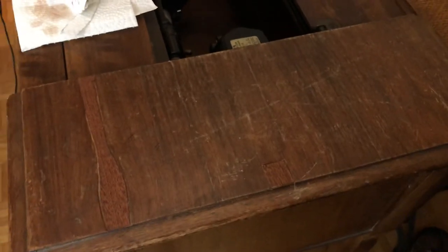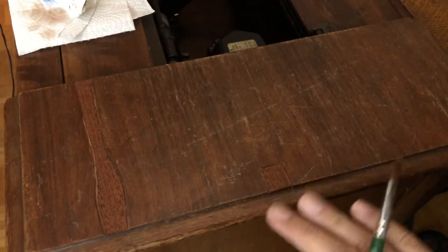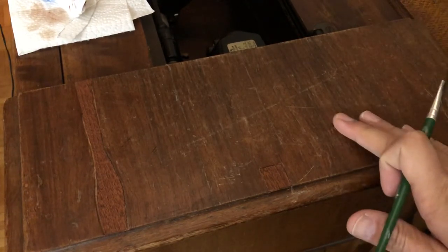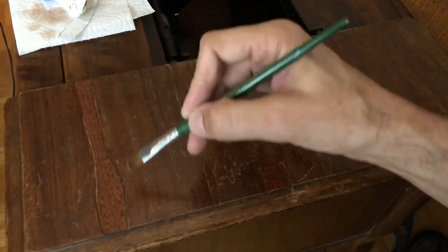You can see it at the moment, but it doesn't have the layer of shellac on it yet. This is gonna have to dry overnight — both of these pieces — then I'm gonna put the shellac on. And when that's dry, I'll come back with the restore finish. Although before I do that, I need to put in my little filler crayons. We'll see how it turns out.